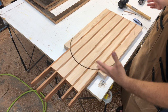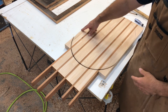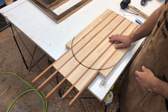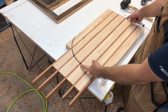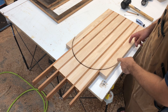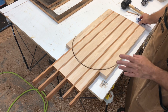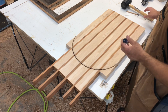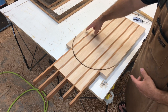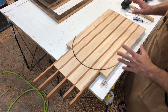The basis of this is you find the center line, you find the center dimension — whatever this is. This is like 15 and 3 eighths, so 7 and 5 eighths is the center of this. From wherever you want to end — if you want this to be 24 inches total or 22 inches — you have to measure in the same distance from the center out. So this is 7 and 5 eighths; you need to measure 7 and 5 eighths from where the line is going to be to where your hole will be. When you use a router compass, you want it where it's not touching on the sides, and as you just come in, it's starting to cut through — that is what's going to give that perfect look of the oval.